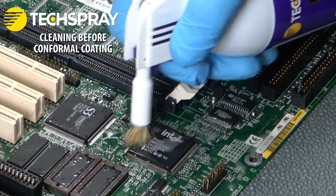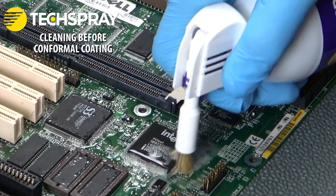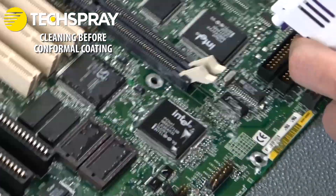Let me explain the advantage of cleaning your printed circuit board assembly, or PCBA, before coating. You are coating because it is required, either because of an extreme operating environment for the electronic device and/or the critical nature of the device's reliable operation. Cleaning is all about eliminating hard-to-control variables from your process so you can focus on the primary factors that will get you defect-free coating and the highest reliability of the final device. Your primary factors include your choice of conformal coating, viscosity, equipment settings, masking keep-out areas.